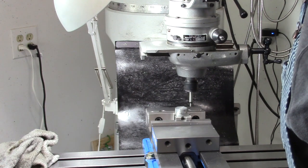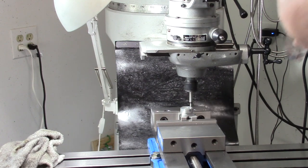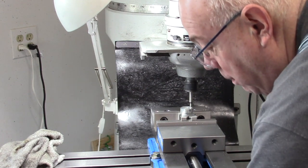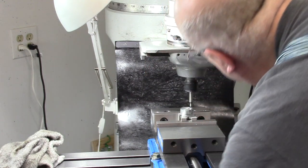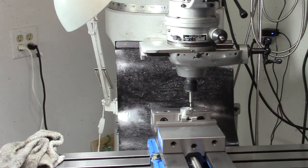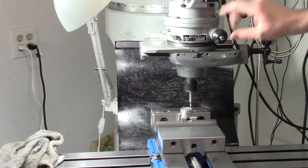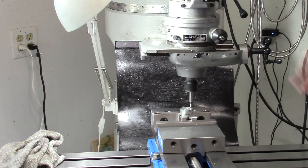They recommend about 2,000 to 2,500 as the maximum RPM. Better go down just a little. And they also suggest using no more than a 3/8 end mill, because obviously you're giving up a huge amount of rigidity. But it's got a stop that hits the machine part on here, and you can adjust it on your machine so that it sets the angle, so you can tram that in. For this, I'm not going to worry about it too much. I have not done that, but I did check that zero is really zero, so that's really cool.